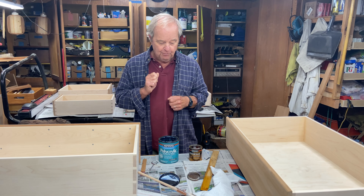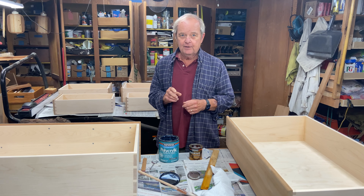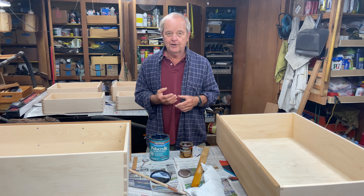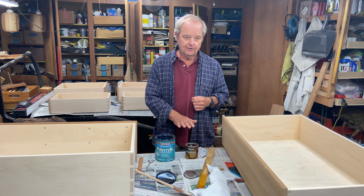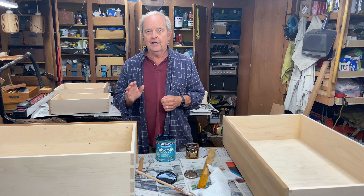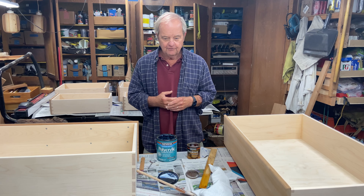You can also buy both of these in spray cans or spray them through an HVLP sprayer like other types of finishes. If the piece you're doing is going to take a lot of wear and tear or it's going to be outside, you'd be much better off using polyurethane. The polycrylic is more appropriate for interior use — not in the sunshine and not taking a heavy beating from kids or other environmental concerns.